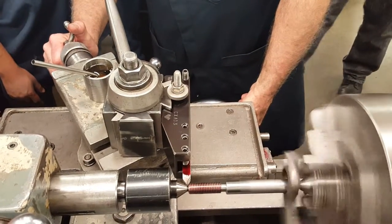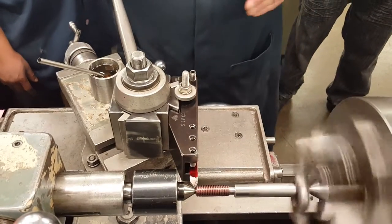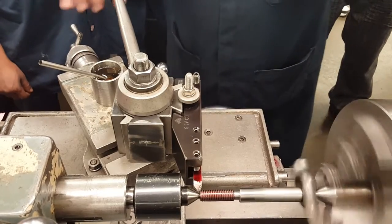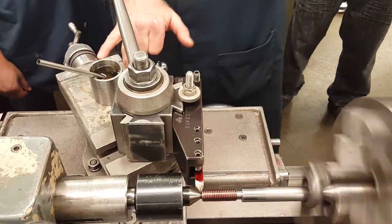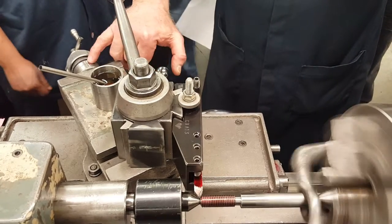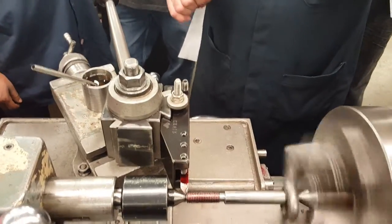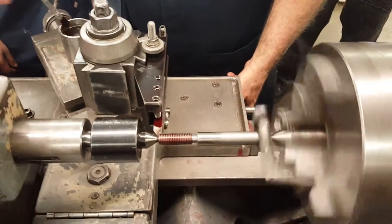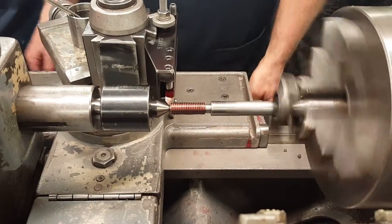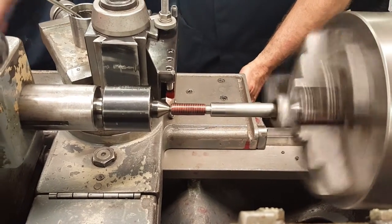How much are you doing there? Well, I really don't know because I'm going in at an angle, but it's less than what it says on here. My zero is right here and that says 175 - that would be 25 - I started at 75 actually. Keep it oiled up, remember don't grab that one - that's your feed. It will go off on the feed run - look at how fast that's turning.